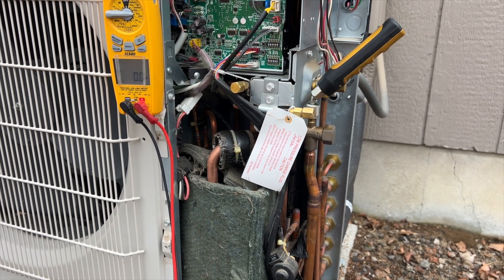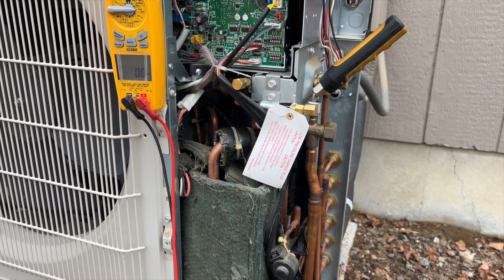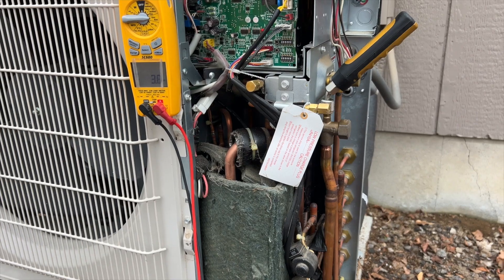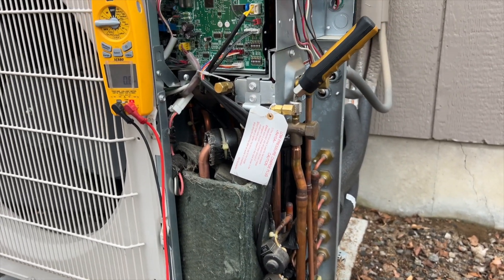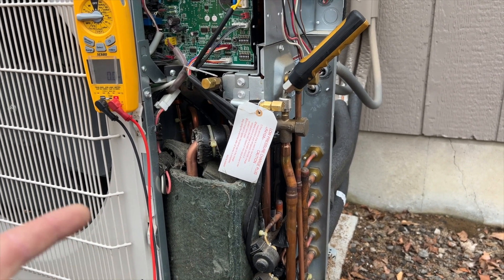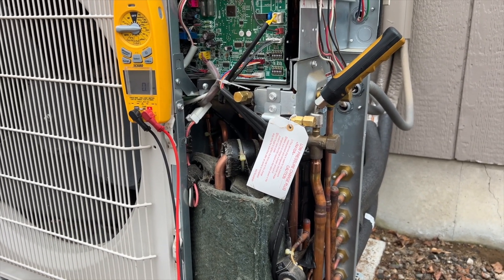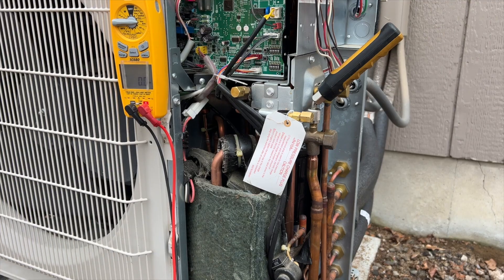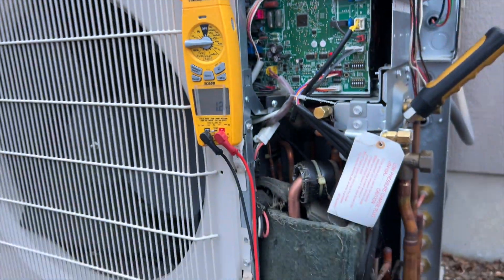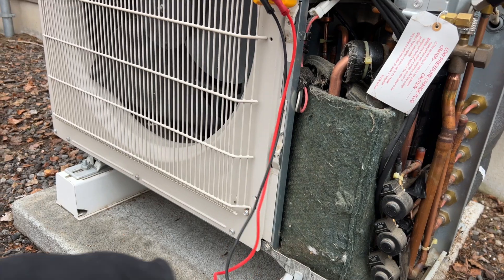Three flashes with about two and a half seconds in between is telling me there's a serial error — some kind of communication problem on the indoor units, on both of them. Usually that just means the wires are hooked up wrong, like the line set is hooked to A but the wire for that one is hooked to B and reversed. But this unit's been working fine for a while, so I suspect there might be another problem. The CNDC — that's from the power board — is supposed to be about 296V DC to 315V DC, and that's reading good.